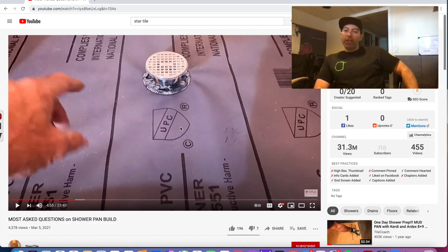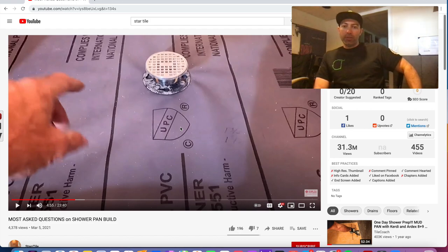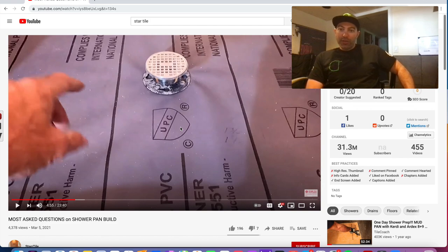The easiest way I find to do it is mark a line on the wall. Take some spacers, a tile, whatever it's going to be that's going to add up to that 1/2 inch. And make the level between your mark on the wall and the drain. That's the easiest way to do it. So not eyeing things up and just going by, you know, giggles here is not accurate at all. Yeah, he'll have a pitch, but you might have a pitch either too little or too much. I mean, too little, the water is not going to drain great. Too much, it's not going to be comfortable to stand on, period.